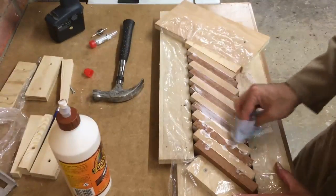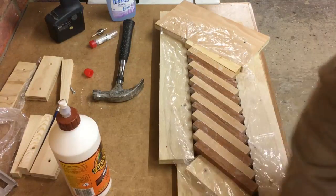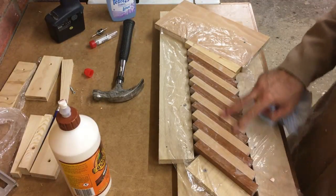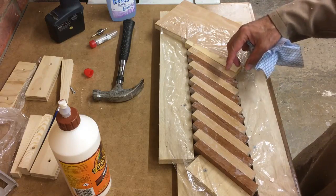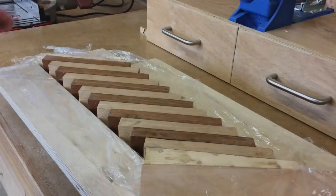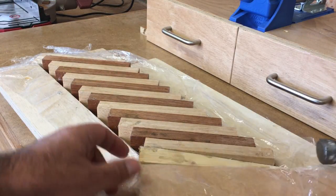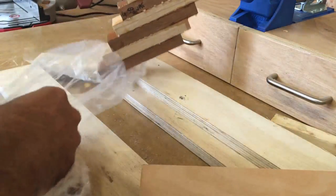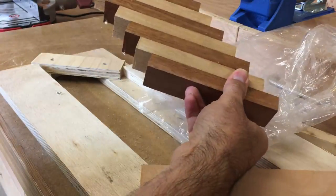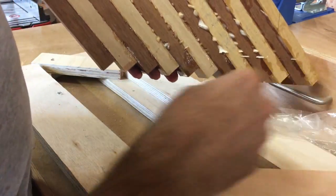Clean up a little bit of that glue squeeze, just to make things a little bit easier. Just leave that in the jig now to go off and let all the glue set up overnight. We'll take that out and then we'll be able to cut it, run it through the planer, thickness it, and then slice it into pieces to create a chevron. Back in the workshop the next day — the glue's all set up so now we're just going to remove it from the jig, knock that little wedge out, and see how well that cling film's worked. None of that has stuck to the jig at all — just a little bit of glue squeeze out on the bottom which we'll clean off and then run this piece through the planer.